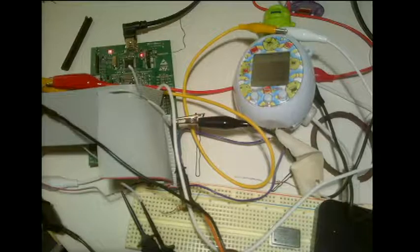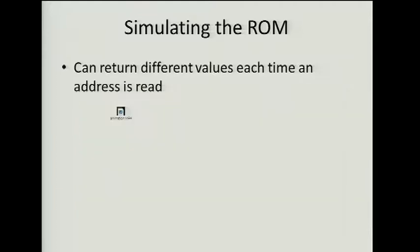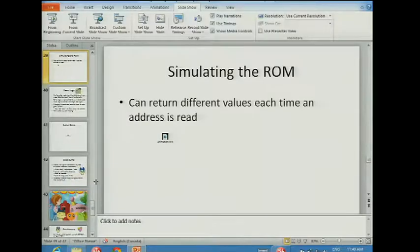So there's my setup. I'll shorten wires when I'm dead. I could do some cool stuff because I knew the image format — I could alter the images. Normally there's something like a wardrobe in the background when you attach a figure, but I made it display my initials. Also, it didn't check the image size other than that it's smaller than the LCD, so you could take over the whole screen. Unfortunately, I was hoping it might overflow the LCD RAM, but it doesn't.